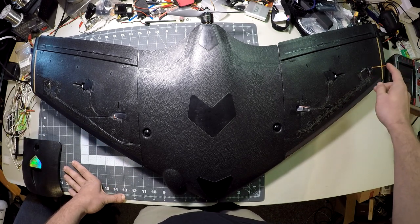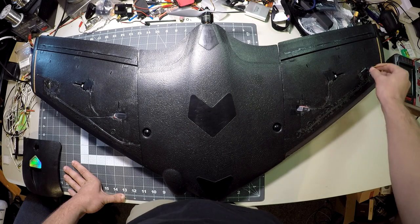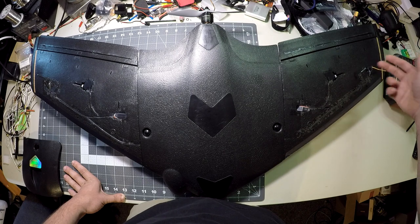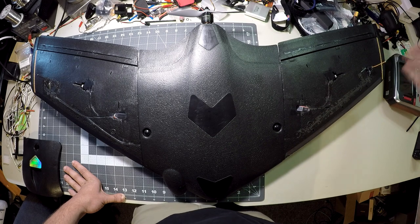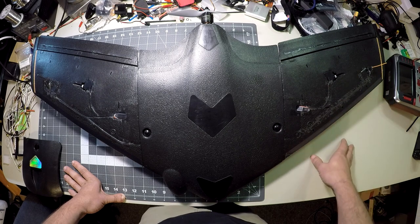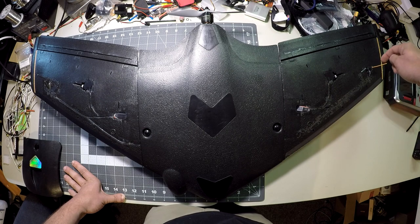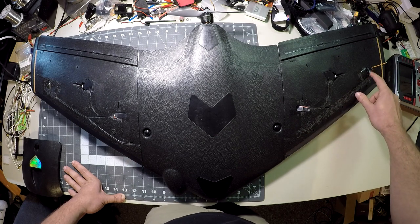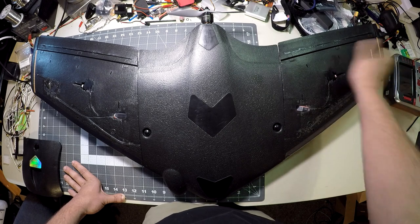On this side, this is just a piece of wire that was part of the Dragon Link antenna — I removed the little plastic tubing guide that holds it straight. The wire may flex a little in the wind but it's fine — it doesn't really affect the antenna tuning enough to matter. Just make sure you have your grounded element hanging down and the active element on top; you want that active element to stay vertical. I have a little skid down here to protect that antenna when I land.